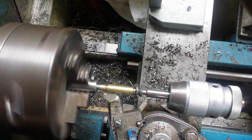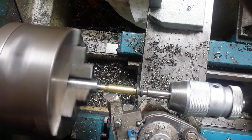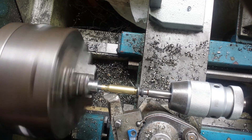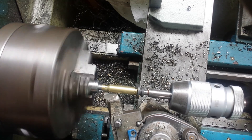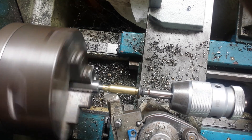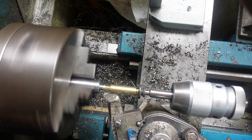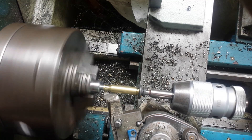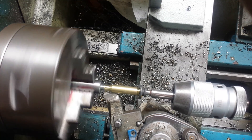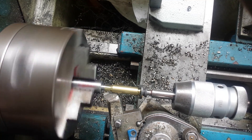And then I will turn down 0.8mm. That sounds quite a lot, but in reality, even then I have some cases that barely skim off the surface. So as you can see now, I'm really creating not much of a chip — it's very tiny. This case actually seems to be very even because you don't see any irregular chip formation. But some cases I had were actually very inconsistent and I had a very thick case neck.